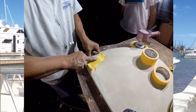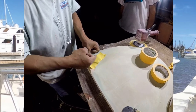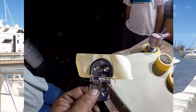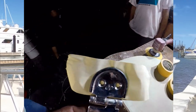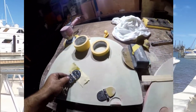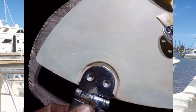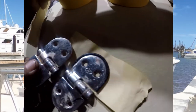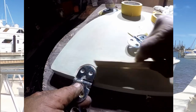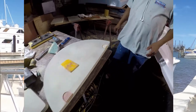That's a hinge he's using to make his template. If you look on the hinge, we put a wire — 14-gauge wire — to give us the space that we want. So when this is in here, you have that perfect space all the way around. This is what it looks like without it, and so this is how it looks — it won't hit. We're going to duplicate that over here.